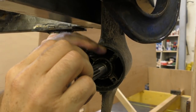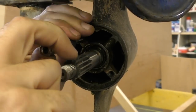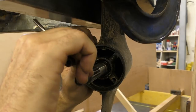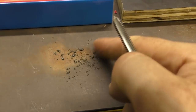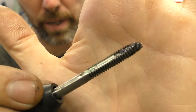Just going to carefully get this started. Normally when you're using a tap to cut a thread, you'll do a few turns one way, a bit of a turn back, but because I'm just cleaning this thread out, I'm just going to mostly be winding it in. It's getting a little bit stiffer now so I might need to use the handle. You can see quite a bit of gunk has collected in the channels of the tap — it would have been quite hard to put the threaded rod in without cleaning them first. A couple of videos ago, people suggested using a bolt or some threaded rod, tapering the end slightly, cutting some grooves in it, and making a homemade tap — that's a good way to go if you don't have one. I'm quickly now going to put a little bit of oil on the tap and just run it through again. That's the result of a second run — definitely got a bit more gunk out.